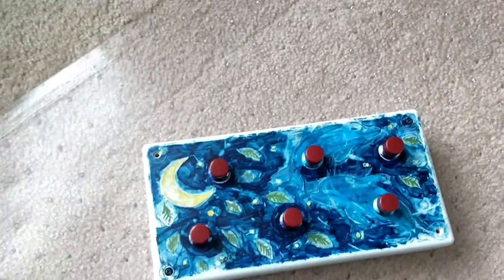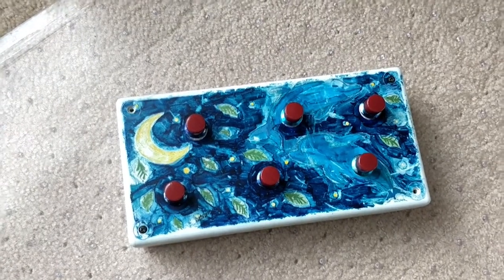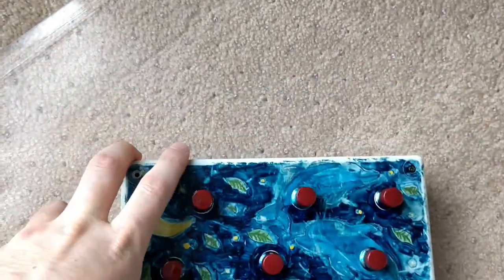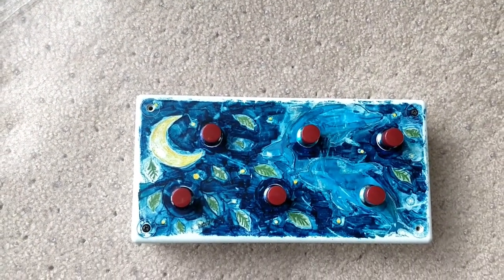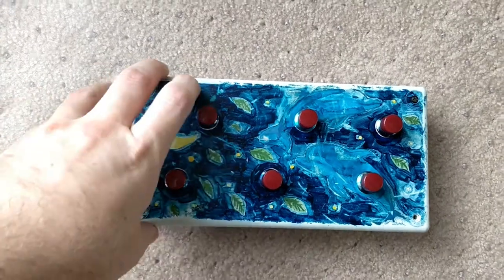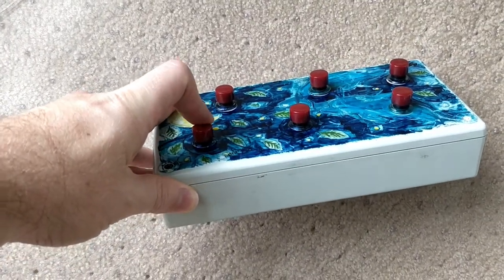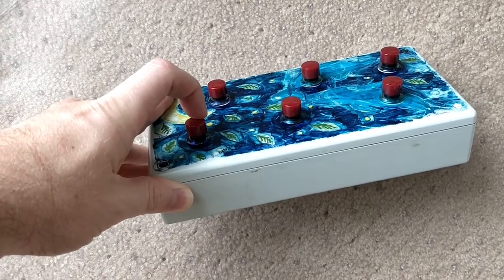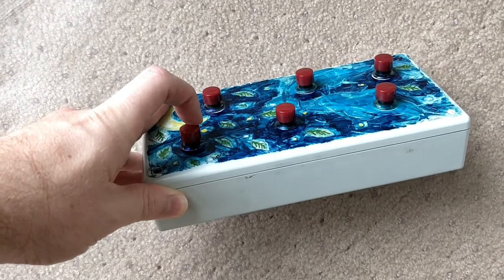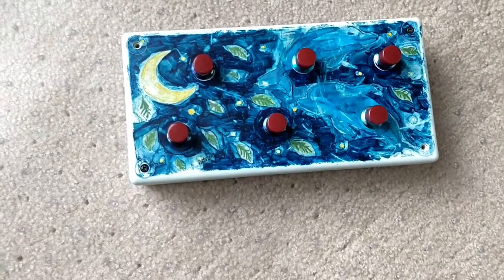And the way I've always done it in the past was I had this homemade USB MIDI controller. This is disassembled now, but there used to be a wire coming out of here. It was just a USB gamepad that I disassembled and soldered the buttons into. And then in the computer, you can use software to convert the USB gamepad messages into MIDI messages, and then use a MIDI loopback software to get those into whatever software you're using for your actual looping.